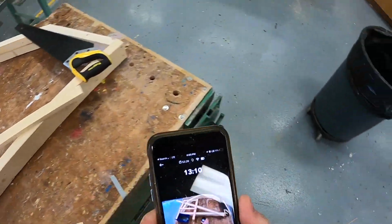So I'm going to glue, squish down, brad, brad, brad, brad. It'll look like this. Glue, a dollop on there, a dollop on there. As I'm squishing down, it is going to be a little bit wobbly because it's now skating on a little lake of glue. I'm gonna press down while looking for my little pencil lines. If you can see them, I think you can. So I'm lined up with my pencil lines. I'm pressing nice and hard. Oh, that guy moved. All right. So I have a little bit of a stick with the glue there.